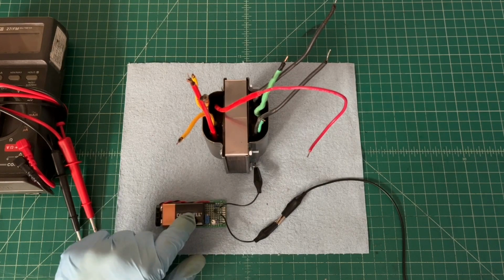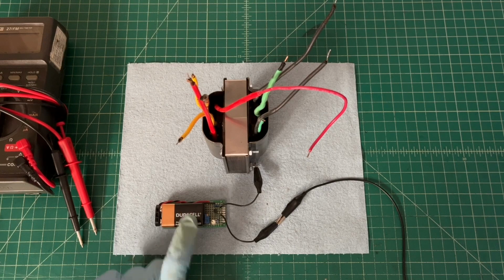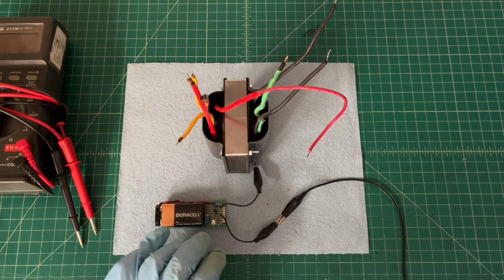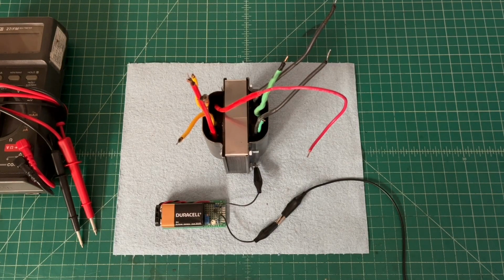But first thing I want to do is use my nifty little tester. I built this to test for leaky capacitors. Of course, about every capacitor you pull from a vintage radio is going to be found leaky. This will allow me to look for a DC resistance up to about 2 billion ohms.